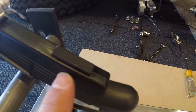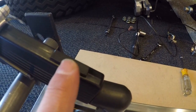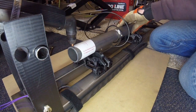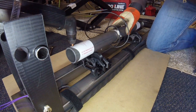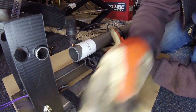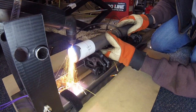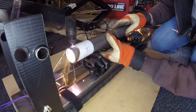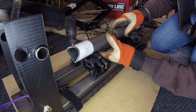What I did is I ran these two wires into my torch handle and soldered them in parallel with the wires on the existing switch. They just come around to a little switch, so when I flip it up it closes those two wires — essentially like holding the button down. I set the torch up, get ready for my cut, flip the switch when I'm ready, the torch starts cutting, I feed it around, and as soon as the cut finishes I flip it off. That's been working out really well.